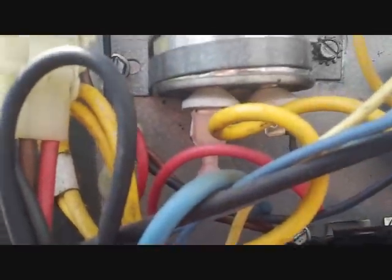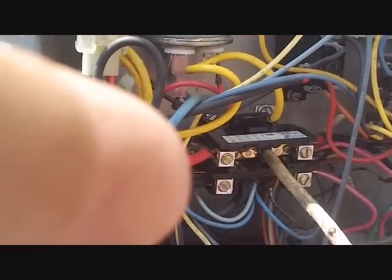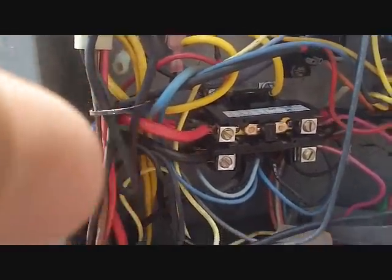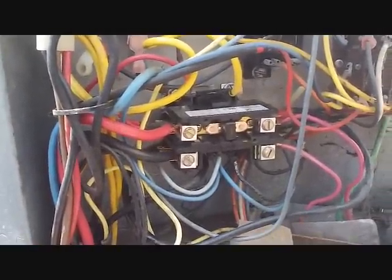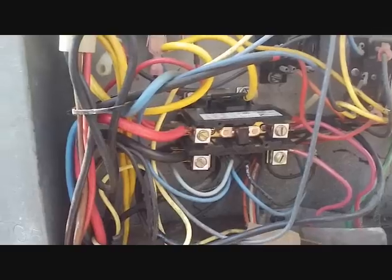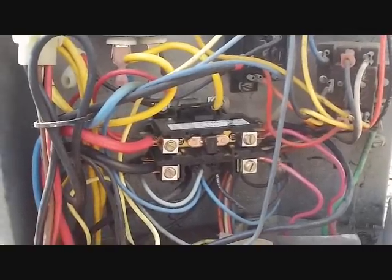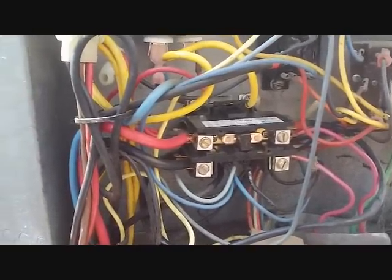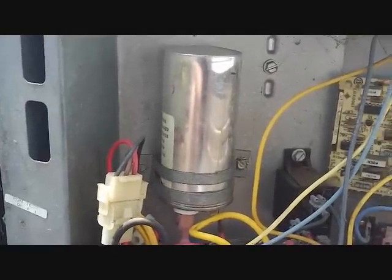What I'm going to do is push the contactor down manually to see if the motor starts — take out the guesswork. Nothing. Capacitor is shot, and that's probably all we have here. Good — because I don't want to have to hotwire it, as that takes a while. It's been a pretty busy few weeks, so let's go ahead and change that capacitor and move on.